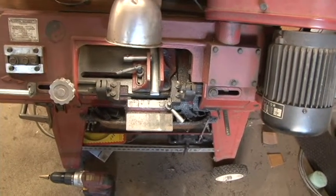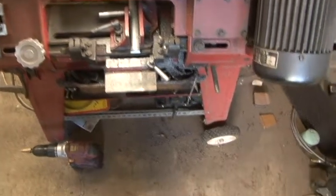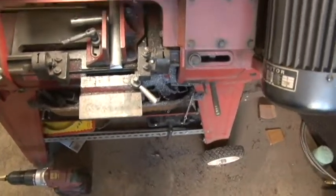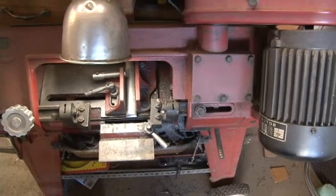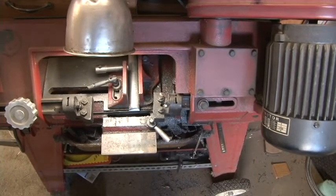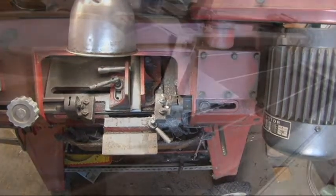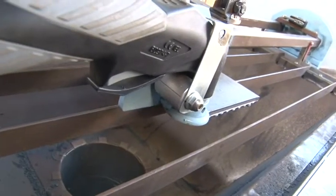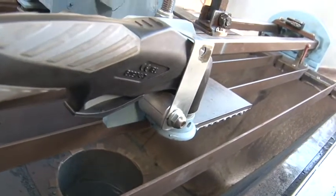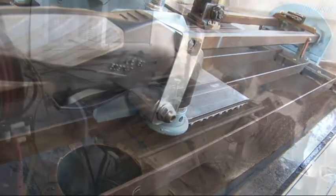One of the great advantages of using a plasma cutter is that these big six-inch pieces are awfully hard to cut on this machine, and it's kind of dangerous if you set it up on its edge because the blade's up so high. I've ruined many a blade trying to cut those things. But not anymore because I've got the plasma cutter. This gives you a little bit better view of that roller I put underneath there — it kind of holds up this handle in there, and it really holds it tight too.